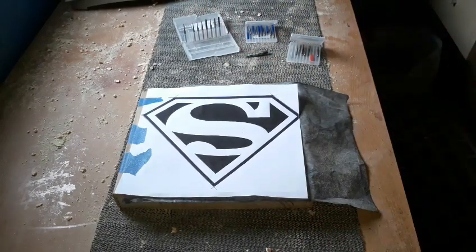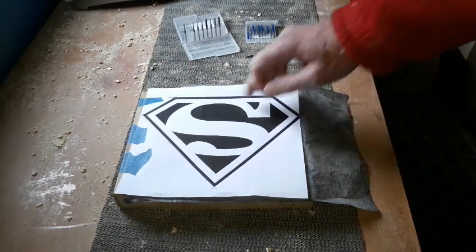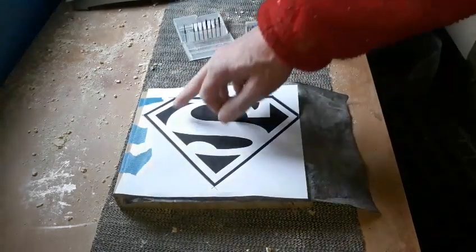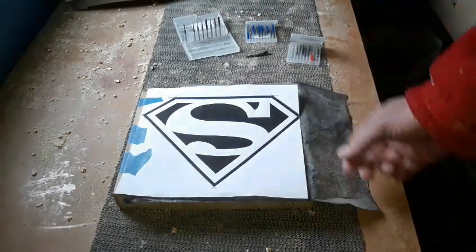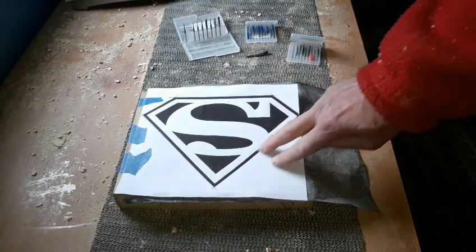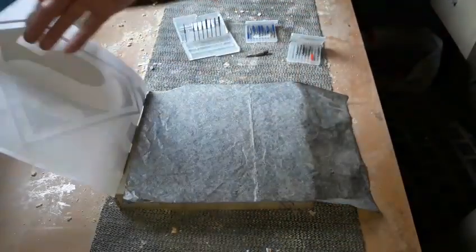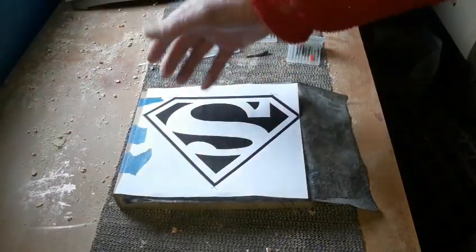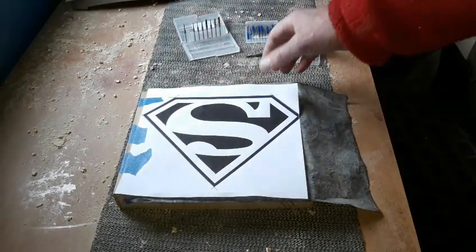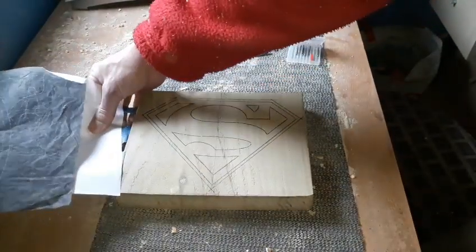As always, once we've got the template on the piece of wood - just sticking it on with a bit of painter's tape - I like to use carbon paper and literally just draw around it. Nice and easy, a lot of straight lines here so I'll let you use a ruler. Put it up against and off you go. Once you've drawn around it, we can remove that paper. If you're really good you could stick that straight there if you wanted to and route over the paper, but once was enough for me.